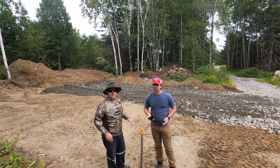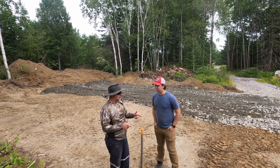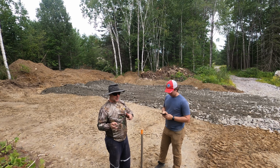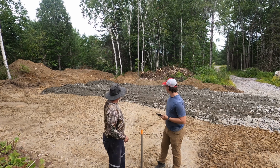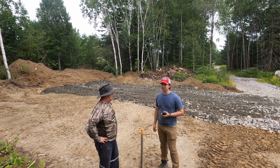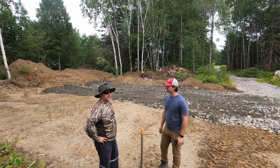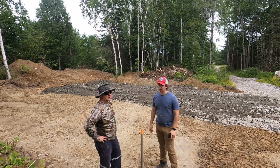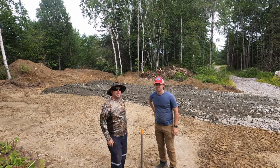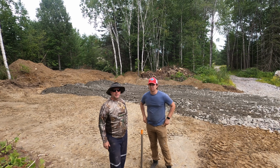Okay, so that means that according to this post here, our front corner driveway top corner trail to that one and this one, we have to still build it up 2 more feet. So that's going to take probably three more loads of 6-inch minus, something like that. So we definitely have our work cut out for us, but that's gonna be it for this one.